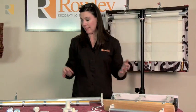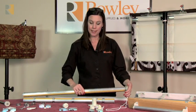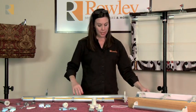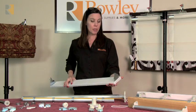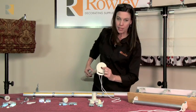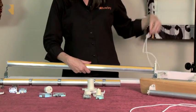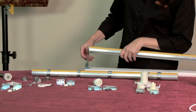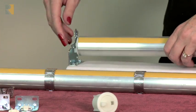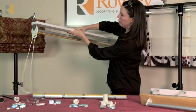It's simple to put together — probably the simplest shade system ever. You literally put the clutch in one end and the end plug in the other, and set it in your brackets. Here are the brackets; I've already installed them on the board. One end has a flat pin, and that's going to fit into the clutch end. You can go ahead and set that in place with the bead chain coming down. The other end fits into a swing arm bracket — you just need to turn the pin around so it falls into place and then lock it in.